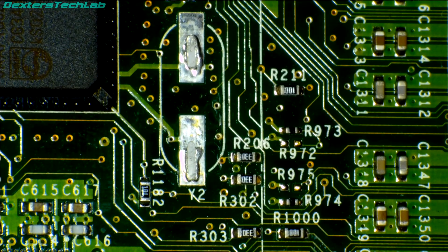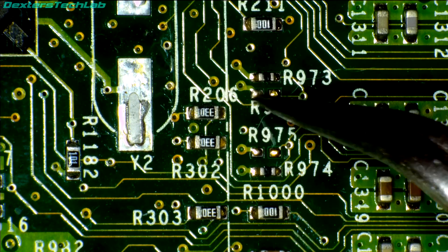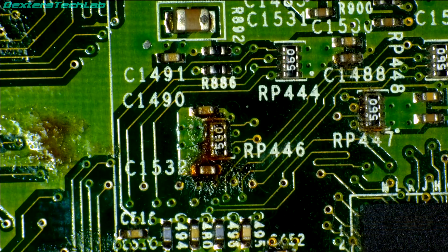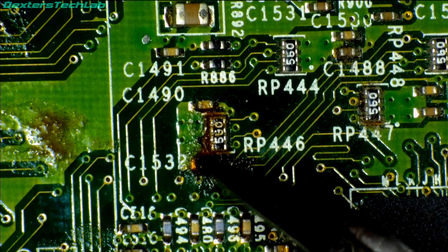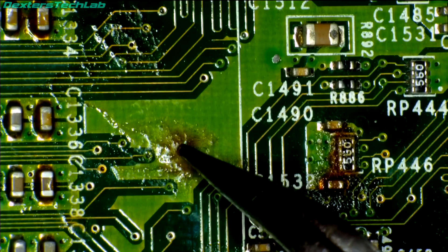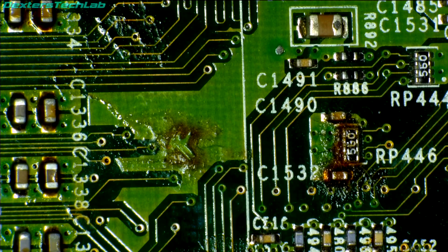Here's the area in question. See around here we've got R972 but see how the pads are rounded off - that means that they were never installed in the first place so they're not missing at all. So I can't really see anything that might be a problem. This looks a bit gunky down here - this looks like flux residue. It's not been cleaned off properly so I might give that a bit of a clean just to get it off.